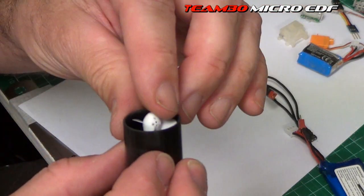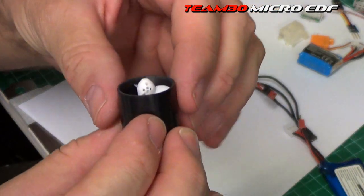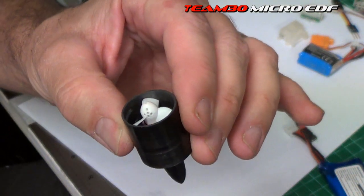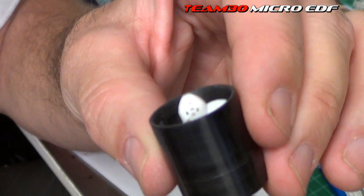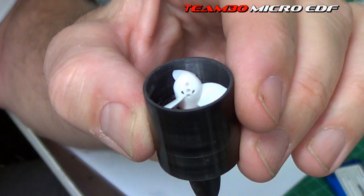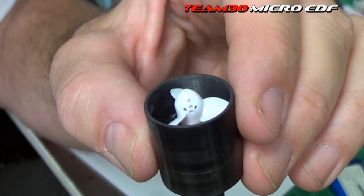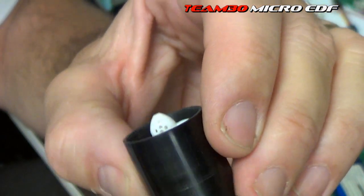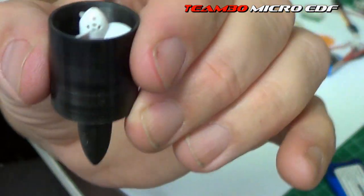Because this is a chopped-up three-blader — I've seen it before apparently, according to Pete — you can see the amount of holes I had to dig into that side. I had to drill several holes to balance this sucker out. These things, when they're injection moulded, are quite uneven. So it always pays to balance out your unit.